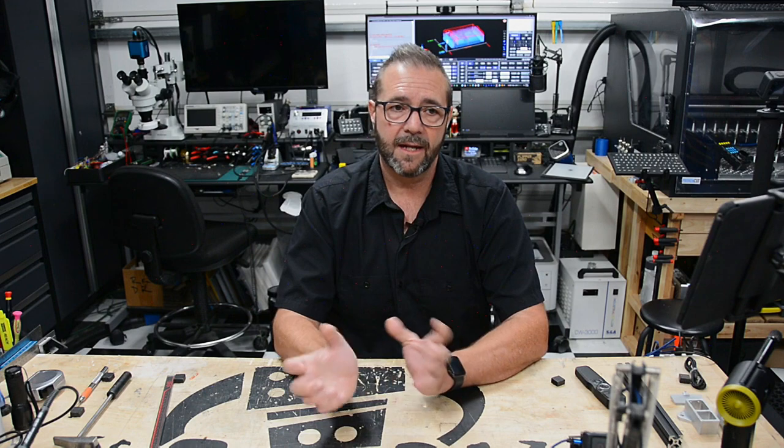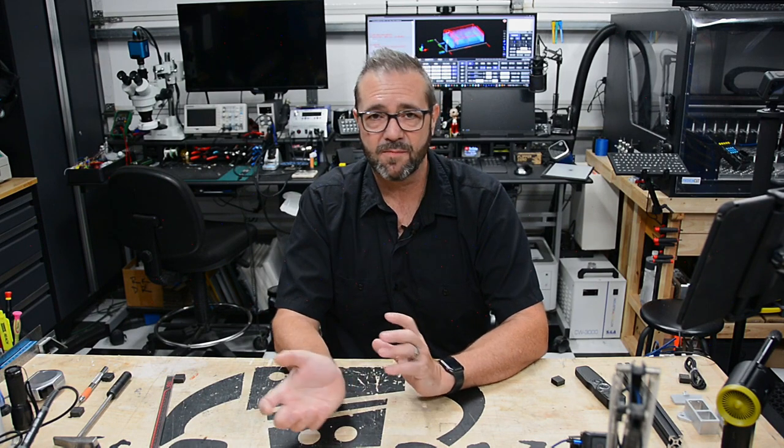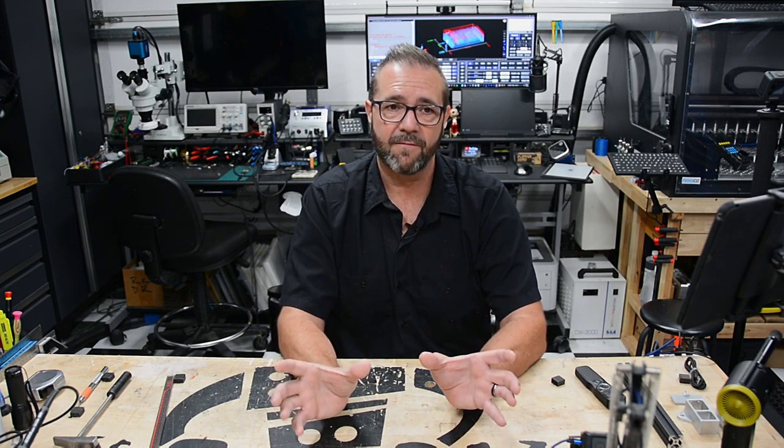There's probably 10 or so different open machine controllers that you could pursue that will provide that additional I/O, and each comes with its own amount of complexity in how you set it up. If you're going to go with a new controller, chances are you're going to need drivers and relays, power supplies, VFD, and everything of that nature to create your technology stack for your machine